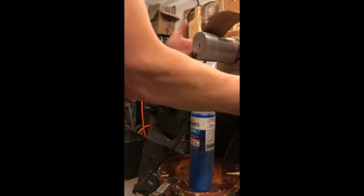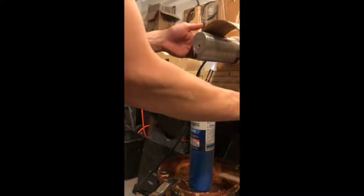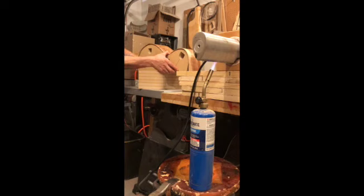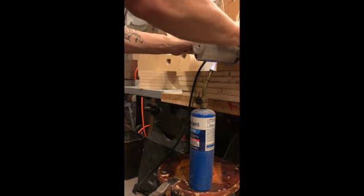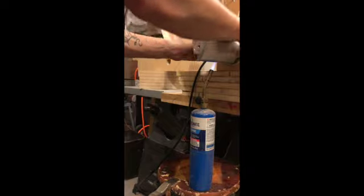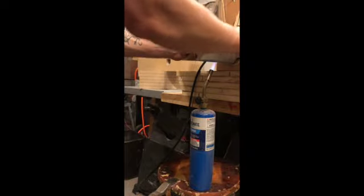Right now I build so few acoustic guitars, and when I do take the time to build one, I tend to use materials that I really like. I think I may be building a few more out of alder — it's one of my favorite woods for electric guitars. I've seen acoustic guitars made from alder, but I've never done back and sides out of alder. Right here it's fitting pretty nicely. I'm going to tighten up this waist again, set it into the mold with some clamps, wet it down a little bit with my spray gun, and then hit it with a heat gun. Being that it's the evening, I'm going to let that sit overnight.